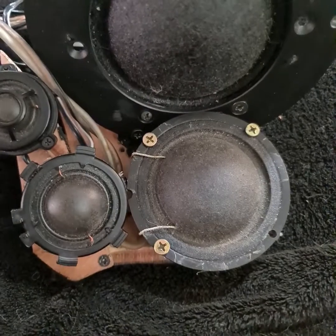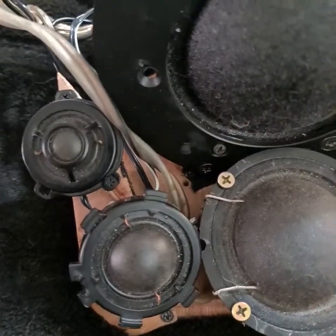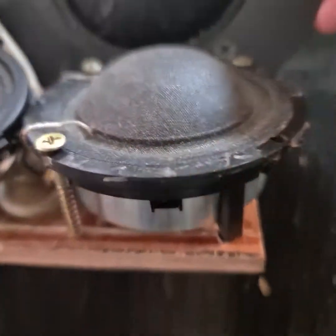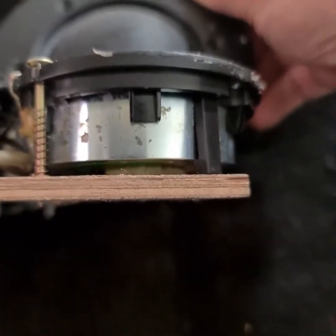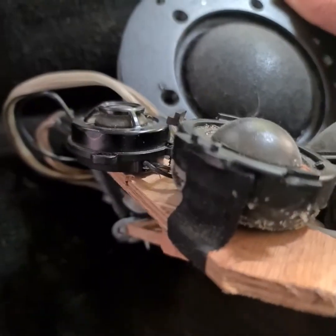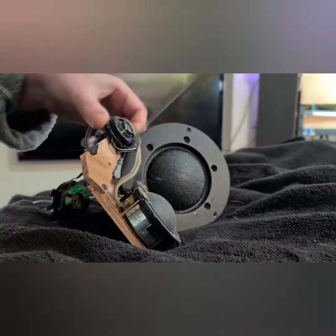That's a 76 mil coil in that one, and the 52 mil coil driver unit, which is from a VW Passat Dynaudio equipped vehicle, did not have a rear chamber, and I just had a small foam plug in there, as you can see, wedged into the magnet gap, but behind the diaphragm.